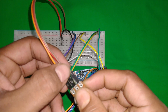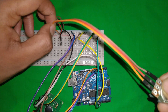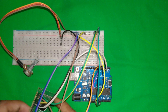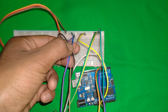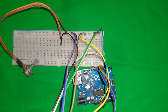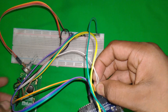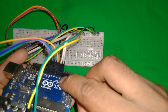The potentiometer connects to 5V and ground on the breadboard. We are connecting the contrast pin to the potentiometer. Pin number four and pin number six — pin four is the RS pin and pin six is the EN pin — are connected to the digital I/O pins on the Arduino. Pin four connects to digital pin 5 on the Arduino board, and pin six connects to digital pin 6.